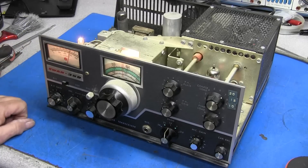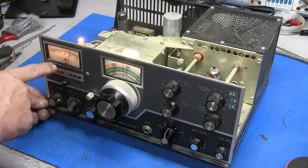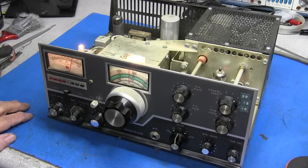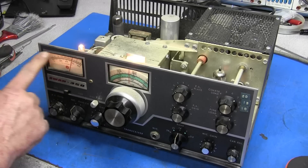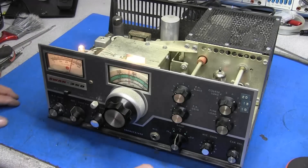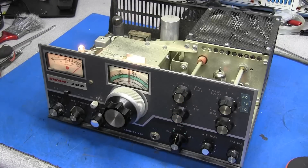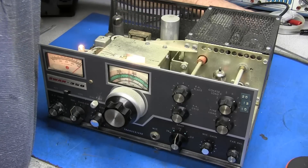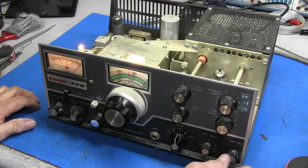She's sitting here running — you can hear hash from the speaker and we can see the S meter is up. These S meters are a little backwards from your standard radio — one is here, 60 over is on this side, so on receive the meter goes this way, on transmit it goes that way. I don't have an antenna hooked up so we need to scroll in the antenna. RF gain is up, mic gain is halfway, carrier balance halfway.